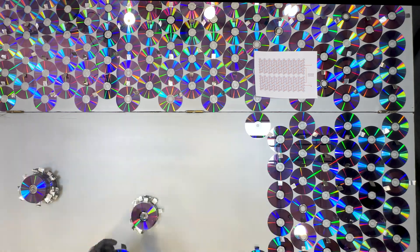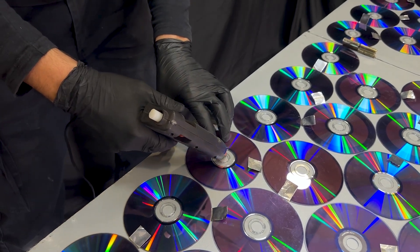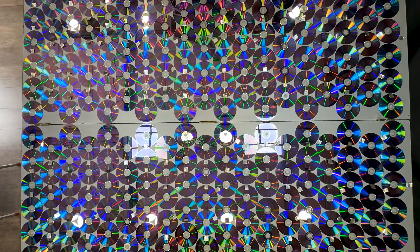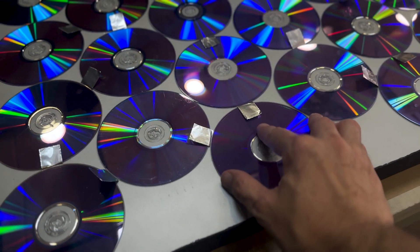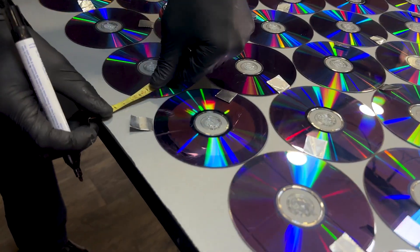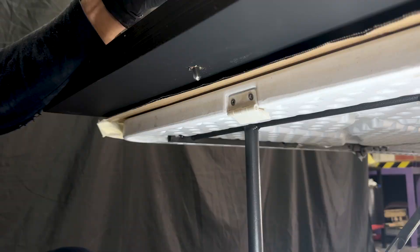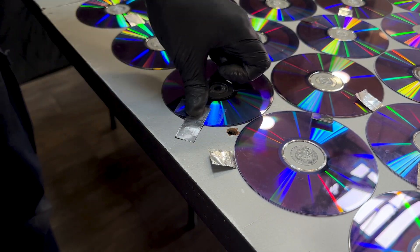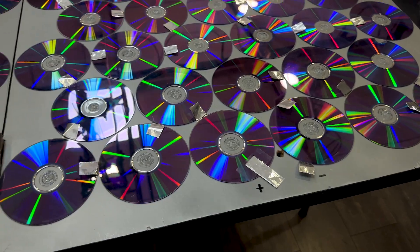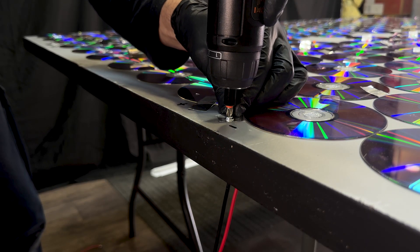Now that we have correctly positioned our photovoltaic cells, we must glue them to the wooden base with hot glue so they do not move. They are very well glued. Now we mark where we need to drill and make two 10-millimeter diameter holes. We put a strip of aluminum foil here and tape it — this will be the positive terminal and this the negative terminal. We do the same on the other part. Now we pass the ends of the wires through the holes we made and fix each wire with a screw to the solar panel's electrical terminals.